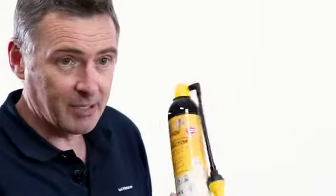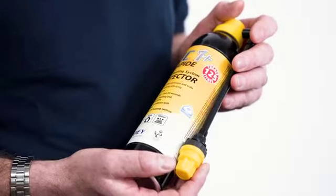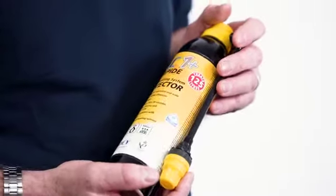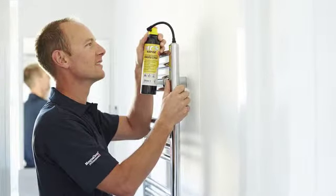The product is available as a 500ml, but also as Rapide — the same as MC3 Plus Rapide. It goes in either into a radiator or into the filling loop against system pressure, so it's easy to dose. You can dose this into a system in around about 20 seconds.